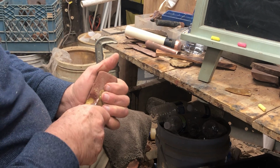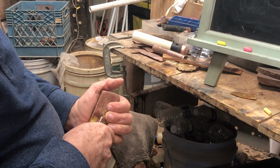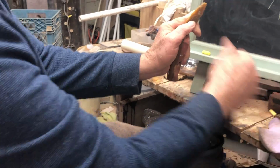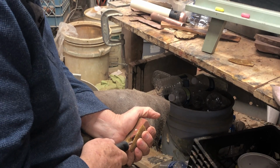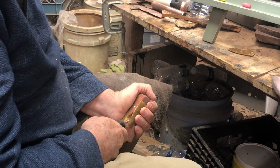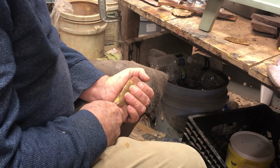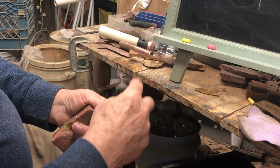Now, I'm gonna turn it up a little more. I'm gonna say what I meant to say. I didn't have it rolled over enough, and it was rounded and it was sliding off. So now I rolled it over more. I put it on this side of the center line like my thumb. I rolled it over more. So now we're gonna come in here. I gotta be careful because I don't want to take the other side off. So I can't put as much pressure on here. And I'm probably gonna chip straight down right here on the point because I don't want to run without a 16th. All that chalk's gone. So let's go back and do this side.